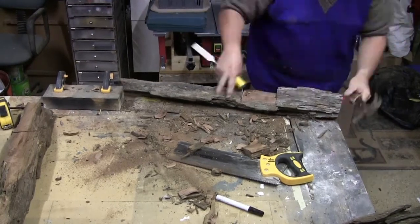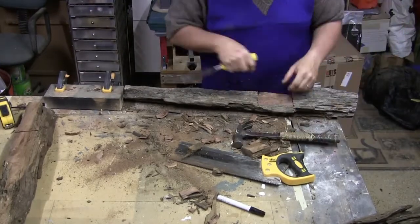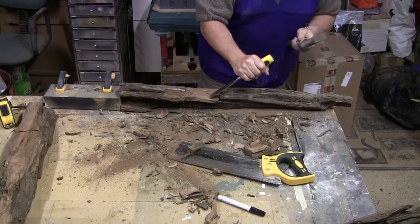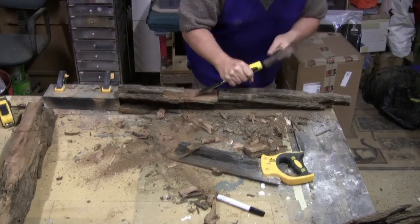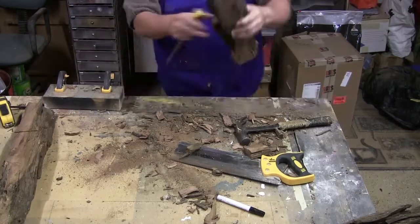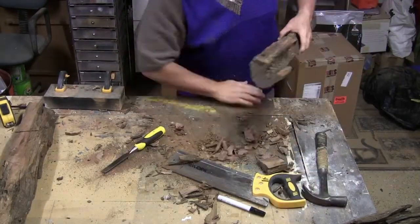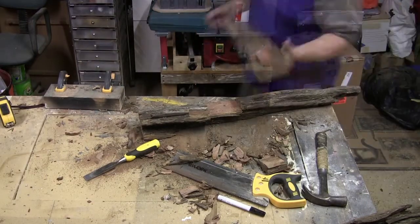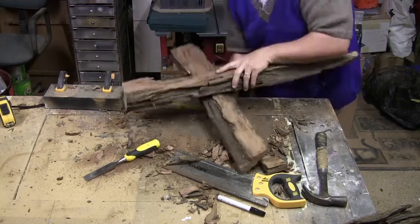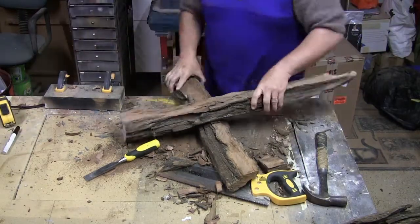And this is just chiselling away the excess timber between the lines. So that was done on the upright and on the cross member until they met more halfway, so that when they're stuck together they look more like it was an original bit of sawn timber that had a bit more construction put to it. So for this one, the end had to be docked off, so I went out and sawed that off and then marked the lines on it and did the same thing.